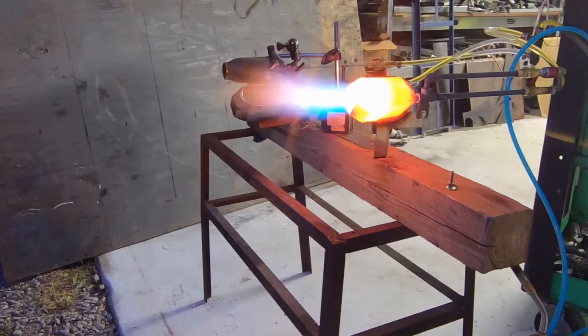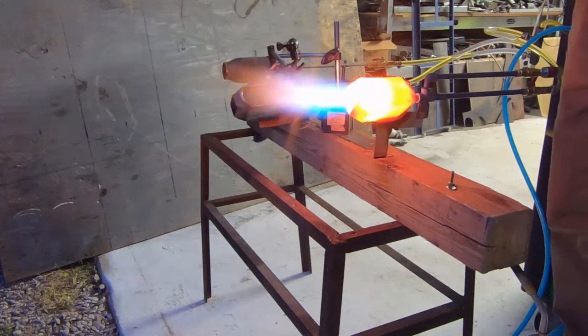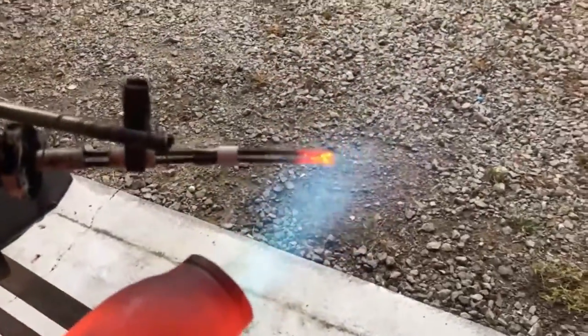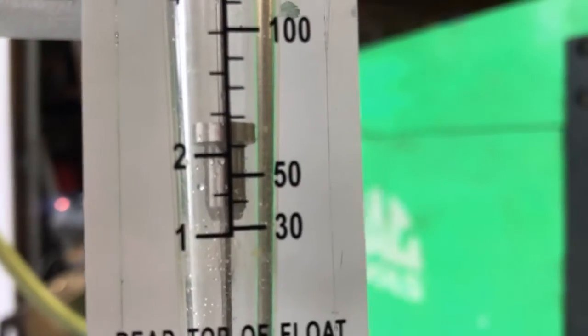This nozzle here is a higher temp nozzle I'm going to try on that combustor. It's a little different — it puts off a lot of heat but it's not as hot temperature-wise. However, it can put off more energy and heat up a larger volume faster, so it's definitely a higher kilowatt output, especially when it comes to waste oil. That's one of the things we have to keep in mind.